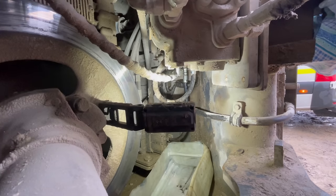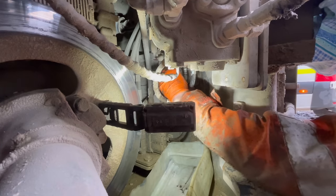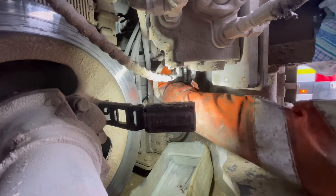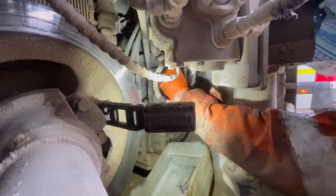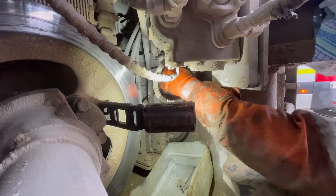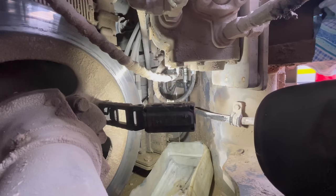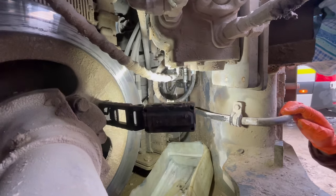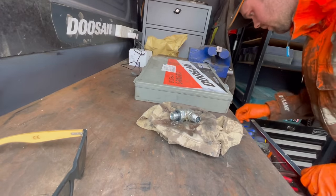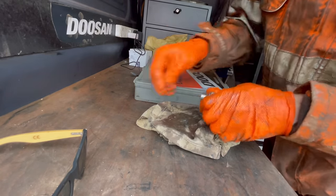Right, I've got a pipe cracked. I'll try and take it off. No pressure in it. Turn that around. See it? That O-ring, not up to much, is it? I'm going to replace that O-ring. So I've taken the fitting right out. I'll peel these O-rings out. If I find a pick, there's a good one. We'll just replace both these seals.